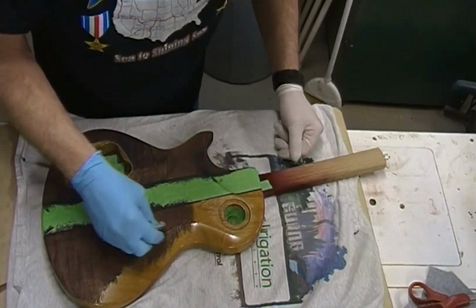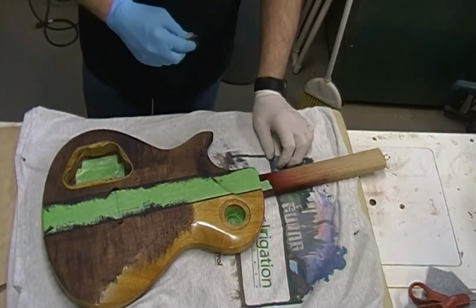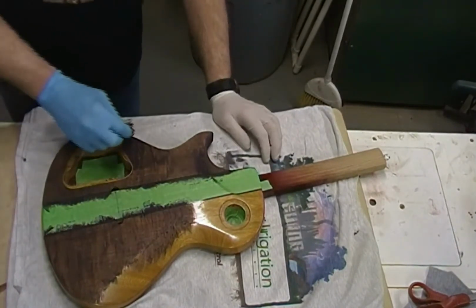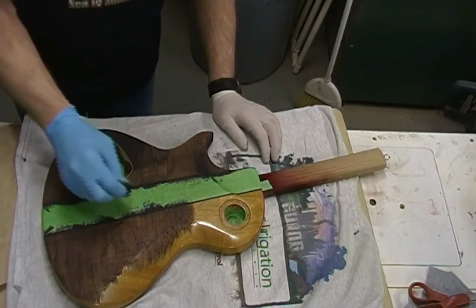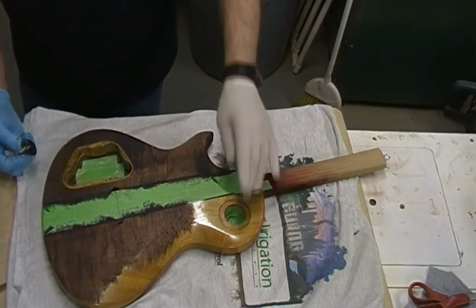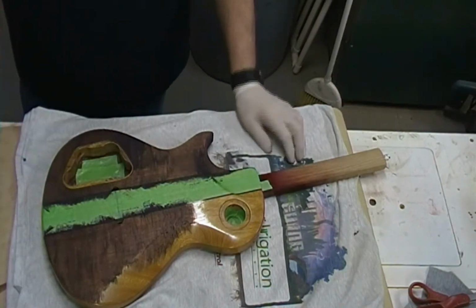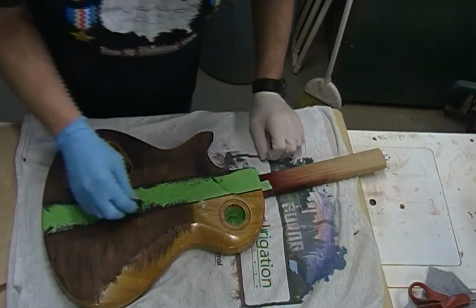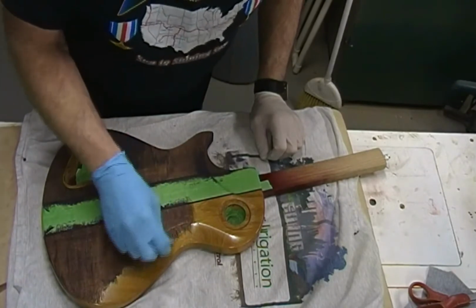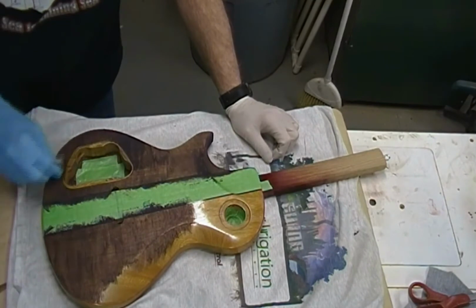Okay, you guys obviously get the idea. It's just slow going, kind of a pain. I'll bring you back when I'm probably sanding this off in a couple days. It should be dry tomorrow, but when I started sanding it after it had been sitting here a couple days, it seemed like the shellac was balling up a little bit with the new 320. So I'll have to find out if I got some more of that open coat stuff, or just go to a little bit higher grit, but I think the next one is going to be 220 or 250. That's a pretty good jump.